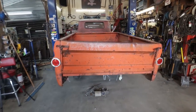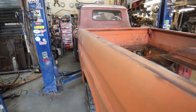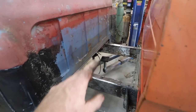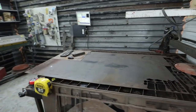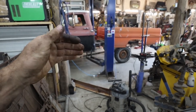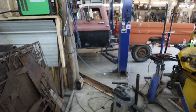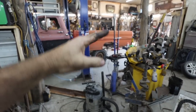Well, my brother needed the tractor, so I kind of loosely just threw the box on here quick. We have welded up, cleaned up the frame. So the next step now is I am gonna cut some gusset plates on the table to beef up the frame. The goal is I'm gonna sandwich one on the outside. We're gonna buzz it in. We'll do a gusset on the inside quick, and then I might just box the perimeter of the frame just to give it some extra meat, being that there's possibly I'm putting a dump on it.